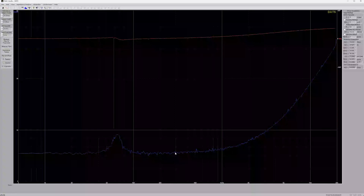A lot of my speakers before have just been a lot of noise. But we can see all of the TS parameters pulled using DATS. We have a 4-inch driver — 4 inches measured from the center of the surround to the center of the surround, so pretty much halfway of the surround. It is almost 72.5 dB sensitivity at one watt at one meter. It's an 8-ohm voice coil, roughly 7.2 ohms measured — it really should be closer to about 6 something.